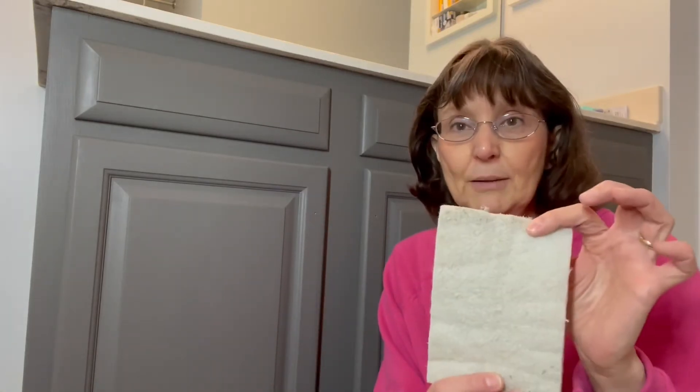I painted two coats and then here's tip number one. Chalk paint is extremely porous, so you'll find it has a rough finish when dried — I waited until it dried completely. What I do most of the time is burnish it. Burnishing just means going over the surface to knock down what I call the fuzzies — basically where the grain may have raised or it's just the texture of the chalk paint. For dark colors, I use our finishing pad and just go over it like so.